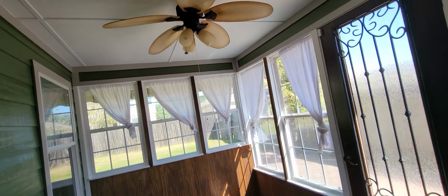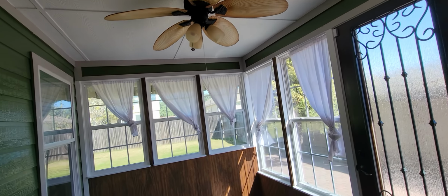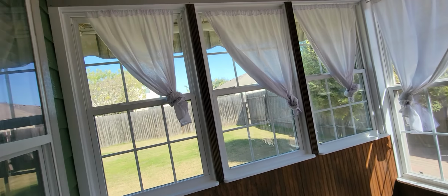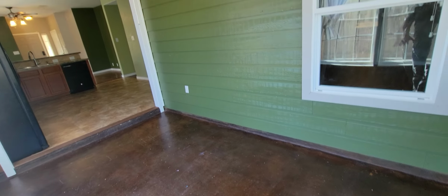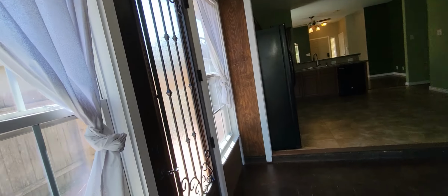So when we have something like this, patios are not designed usually to hold the weight of a roof and everything, unless it was made like that and they actually just closed it in with walls, but we don't really know what it looked like before. So if you came in here and started putting a bunch of stuff on the patio, it could break.